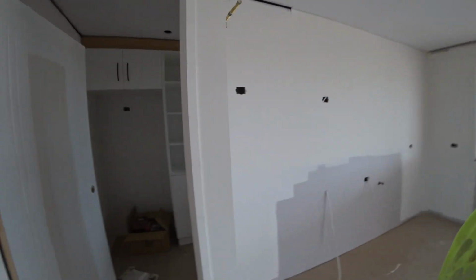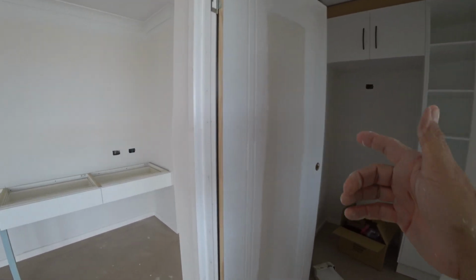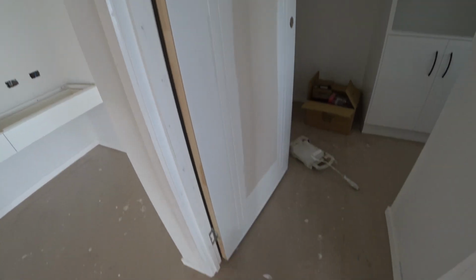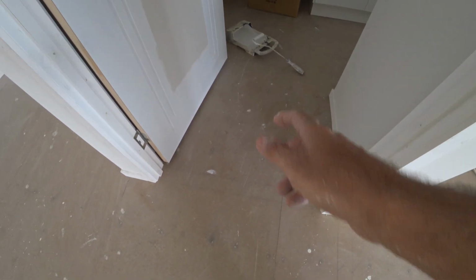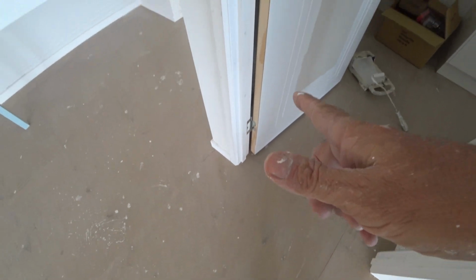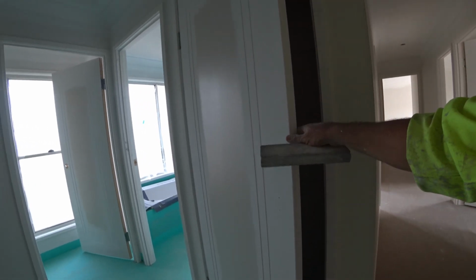So that's how I do these doors. And what we'll do is we'll sand them when they dry. We'll take them off, mark the tops of where they go, and also mark the floor. Like if this is the pantry, so we'll just put pantry in here, pantry on top of the door. Then we'll paint that back edge there. Show you how I go about sanding these doors.